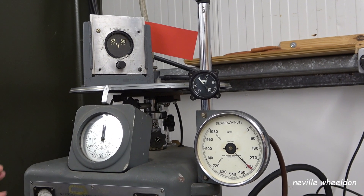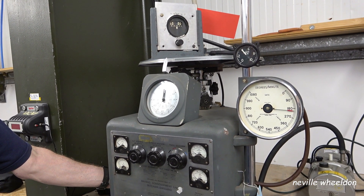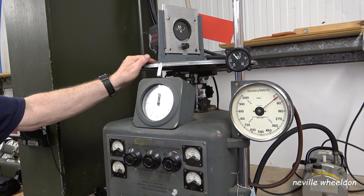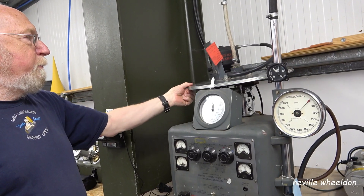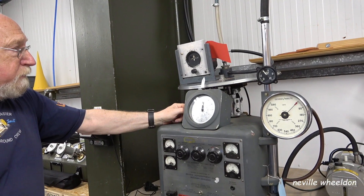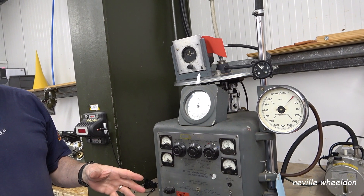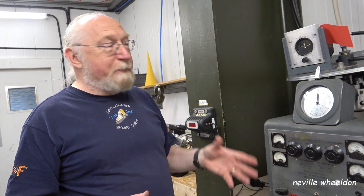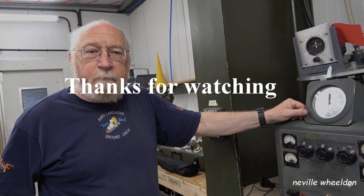Very nice piece of kit — purely analogue. For doing a slip and turn you can actually tilt the table and get the same effect — see whether the tilt of the aircraft affects the instrument. Something you need if you're going to maintain aircraft. This was an eBay purchase. A slip and turn, direction indicator — basically your whole blind flying panel, all the flying instruments on these aircraft. You've got your air speed indicator of course, which is pitot-static, and everything else works off the aircraft vacuum. Spen has uploaded a video on this subject so I'll put a link in the description box.